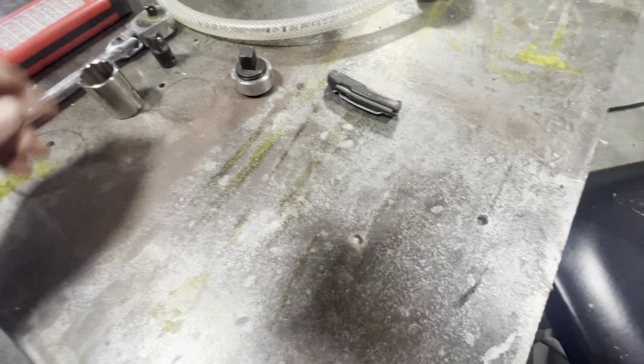All right, here's what I'm going to use to winterize the Nautique with the PCM engine. First, I got some other options. I've got the heater installed, so I use a pick to help with the heater hose. All right, wrenches, an 11/16, 9/16, and a half. Those are going to help get your freeze plugs out of your manifolds.